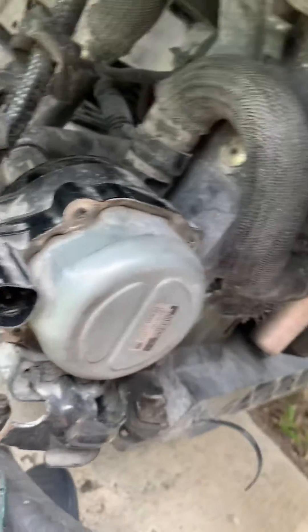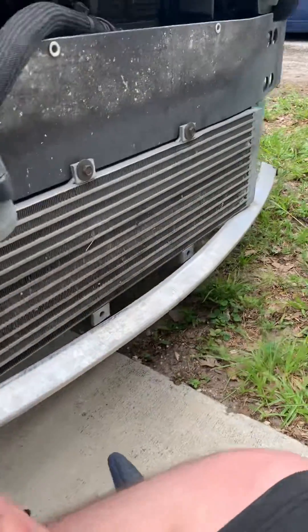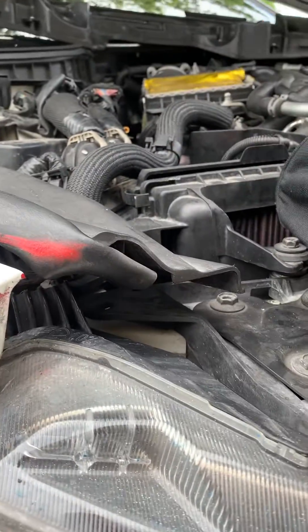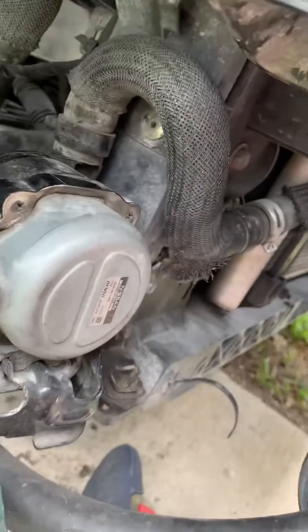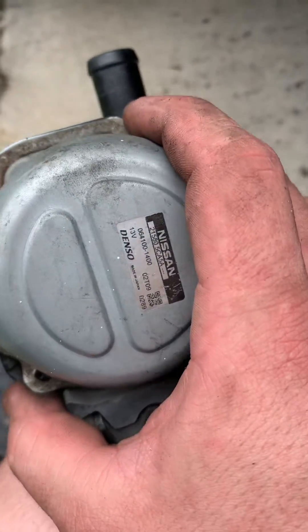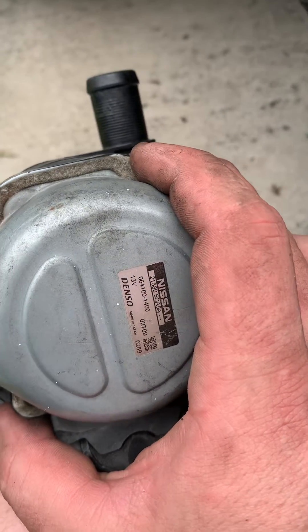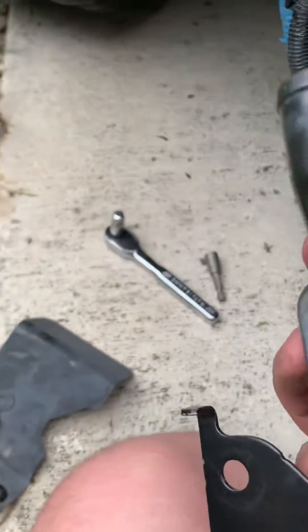A little short YouTube clip for dual pump dual heat exchanger factory OEM with a Frozen Boost 101, to show you how the flow goes. This is the feed line to the intercoolers up top, which comes out right here, then divides into different banks. My pump took a shit unfortunately, but I got a replacement — this is the bottom pump on the chauffeur side.